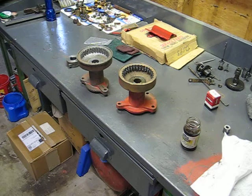But what I do with these is I typically just weld up each tooth and then take a rotary burr and reshape each tooth within the hub. I mean, you can buy repro hubs for these tractors, but at $300+, it's a lot of money. Bill Jenkins actually makes them. They're awesome. I've used them before. I bought a couple sets from him before. But I just can't spend $300+ right now.